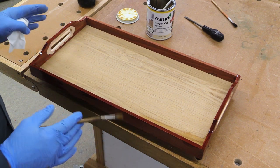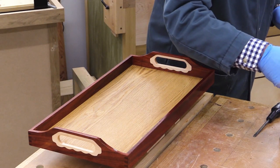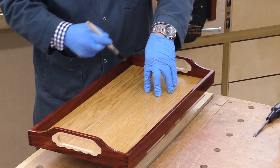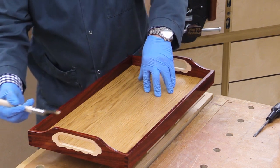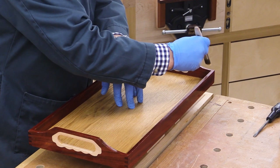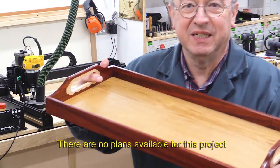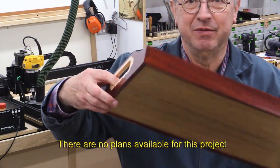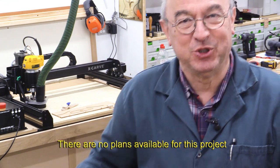It's my intention to put two coats on this. I'm just putting the final coat on this tray now and it really does look good. On this bubinga it is a lot glossier than it would be on other woods — certainly oak. This is a much, much glossier finish, probably because the bubinga has a very fine grain and one can get it pretty smooth. Well, that's it — it's now finished. It's had its Osmo and the Osmo has dried. I'm really, really pleased with this. Absolutely super. Many thanks for watching. Take care. Bye-bye.